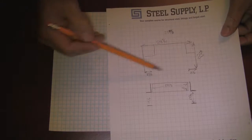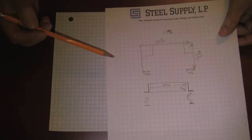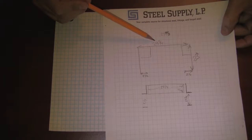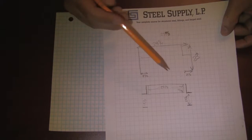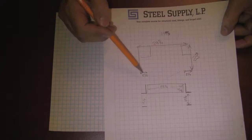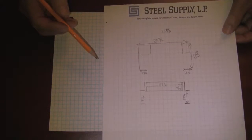So we have a rectangular pantry. What I call a rectangular pantry is one that's rectangular. If you go to my website, go to rectangular pantries, and you get plenty of examples. Here we have one that's 29 3/4 wide, 23 inches deep, and as the door opens and closes, there are little areas on the side where we can put shelves. One's 2 1/4 and one's 2 1/2.